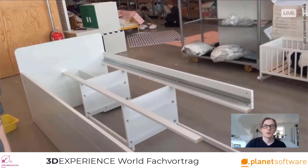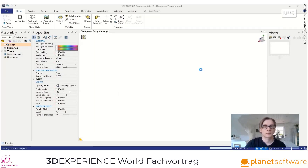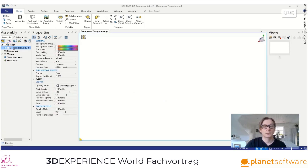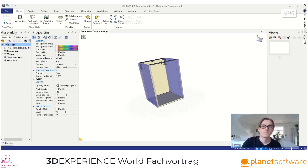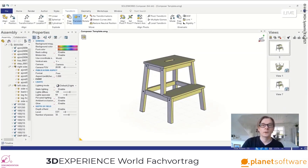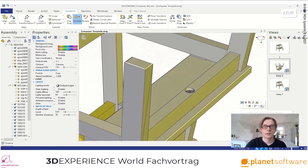So how do we do it? It starts with assembling a physical sample or prototype to figure out the best way to communicate the assembly to the customer. Then comes the digital assembly, which you can see me doing here using SOLIDWORKS Composer. Importing to SOLIDWORKS Composer is fairly easy — I can choose from different configurations in the assembly file, which makes the job smooth if there are different sizes of the product. Knowing how the assembly should be carried out, I start by disassembling the CAD model, creating the assembly flow backwards.